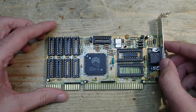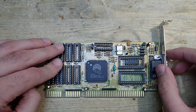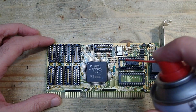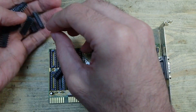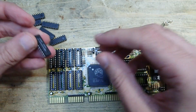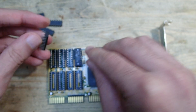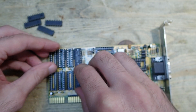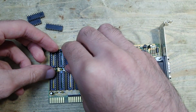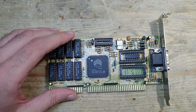Let's continue with the next card from the pile: an ISA VGA card based on the OTI 077 chip made by Oak Technology. This card again is missing all its socketed ICs, but it's not a problem since all the names are written directly on the PCB. I'll add some DeoxIT again and it's time to populate the gaps. First, the video memory — almost all VGA cards from the era used DIP-20 128K DRAM ICs. This card has eight sockets so it can take up to one megabyte. Luckily I had some chips in my spare parts, though unfortunately those are the last I have. I ordered some from China but they haven't arrived yet, and I don't have a good feeling about it — such ICs are notorious for being fake.